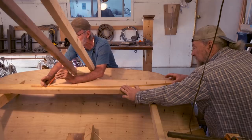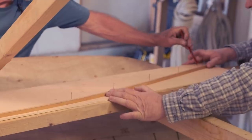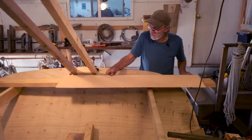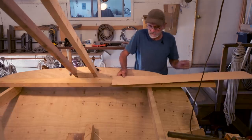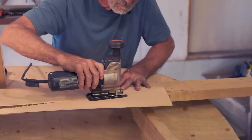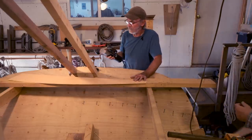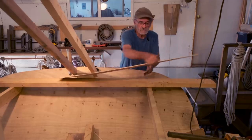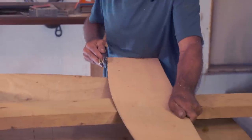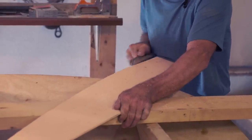We've set up a very temporary workbench — just a 2x6 across these two pieces stabilizing the transom. I'm going to use these little nails on our marks just to hold the batten up against it. We don't really need to nail the batten down; we just need to push it up against the nails and draw the line. We're going to take this batten and pull it right up against the nails like that. You can see it going through the other ones I didn't put a nail in perfectly. All of these things don't have to be absolutely perfect, but they have to be pretty darn good, otherwise you have to dub off way too much material. We're trying to get it as close as we can get it. Now we're going to touch that up a little bit with the block plane. I've left all the lines so I can see the line — once I cut over the line, I'm sunk because I have no reference to plane it.